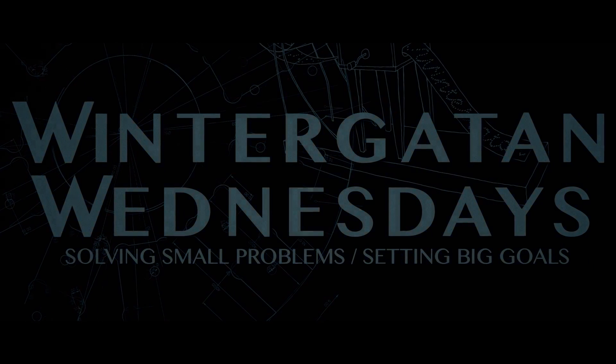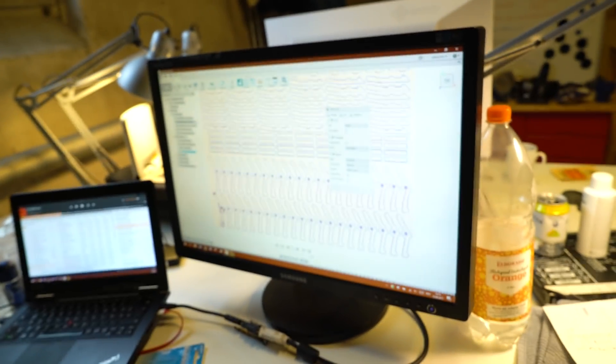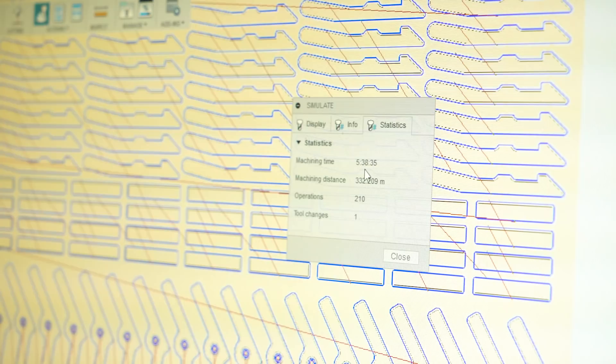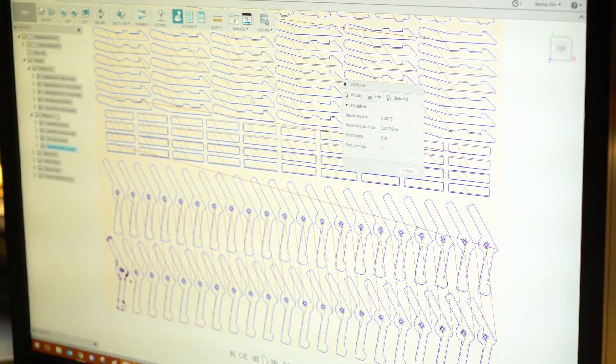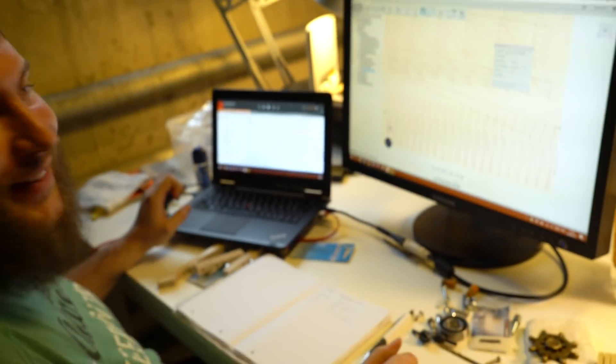So what are you working on? I'm making a setup sheet so I know which tool I should put in with which CAM file I'm gonna put on the CNC machine. The machining time of this procedure is right now 5 hours and 38 minutes — and that's only the milling. The drilling comes additional to that. Almost 7 hours total.